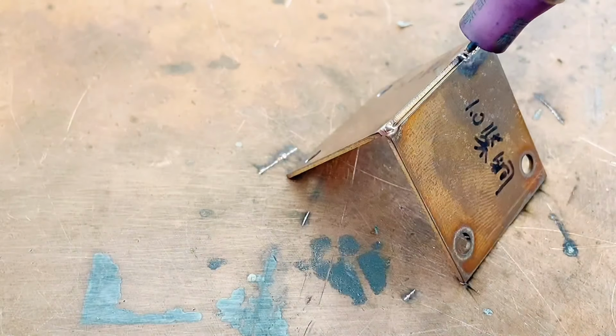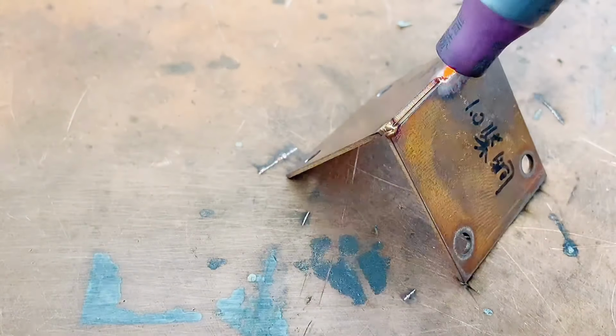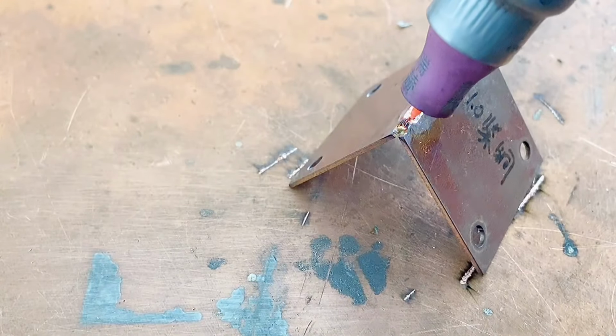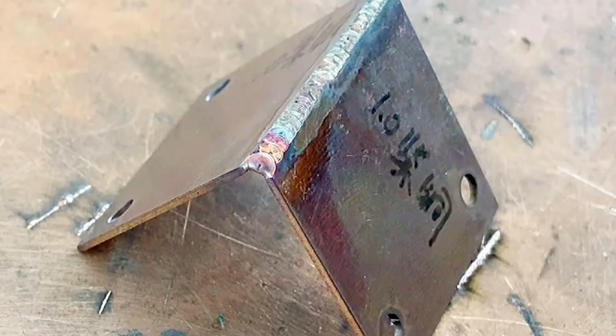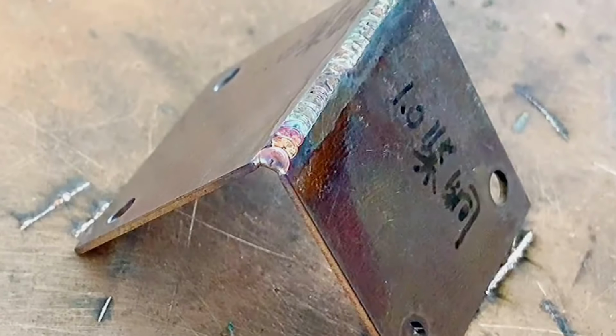When welding red copper, the solder joints also need to be pressed a little denser to make the molding effect better, more full. The mutual fusion of base metal is used for the situation where there is basically no gap. If there is a large gap, it is necessary to select the corresponding specification of welding wire to fill, according to the material of the base metal.